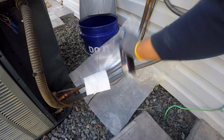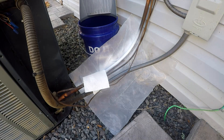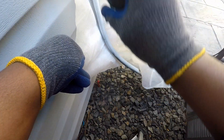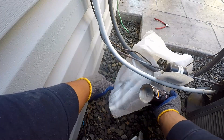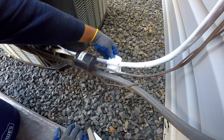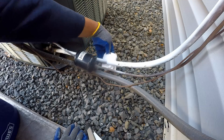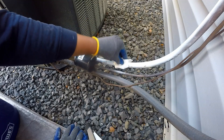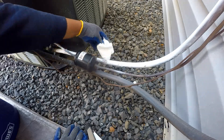I want to avoid giving myself more work. I have to get to the underside of the pipe. I am not able to spray the underside directly, as it is so close to the house and so close to the ground. There is also not much insulation left in the can, making it unreliable in dispensation. I will therefore spray it onto a paper towel and then apply the insulation to the underside of the pipe. When the insulation touches the pipe, it behaves somewhat like solder — it bubbles like an antacid.